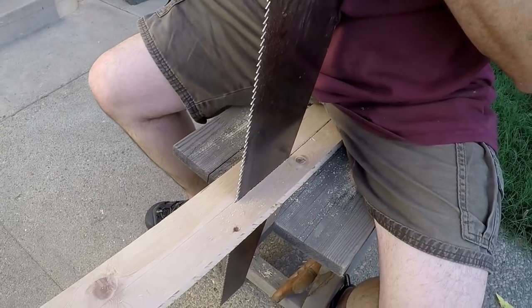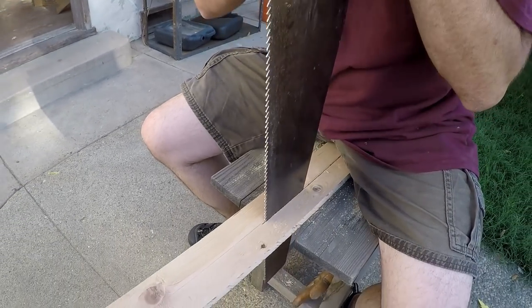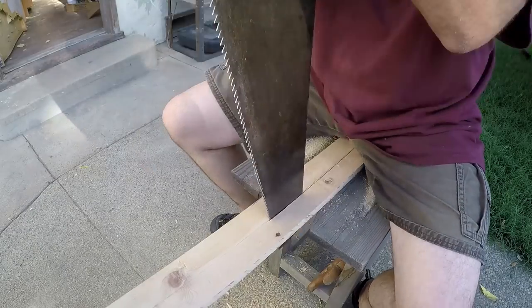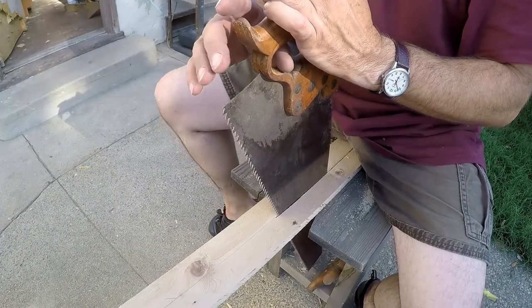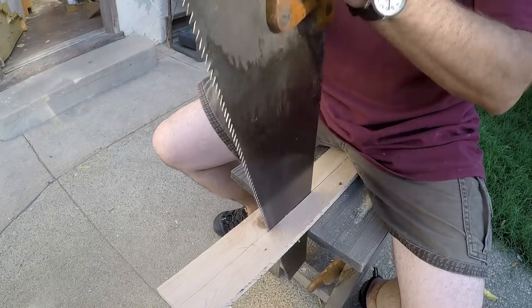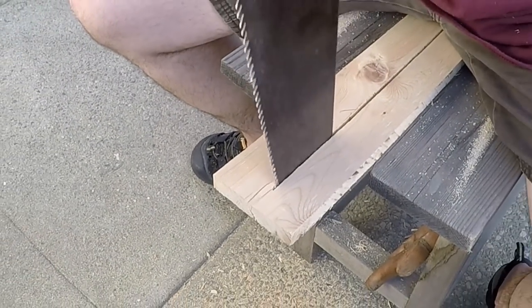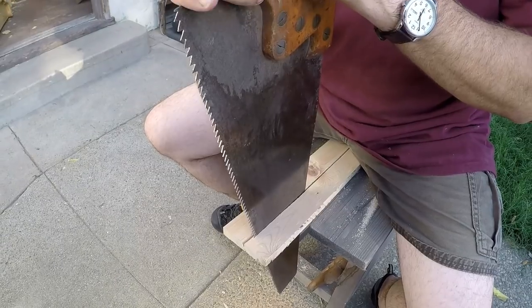You can also sit down on the blade and hold it this way — rip vertically. You guys can see my hands kind of like this. It's actually a very comfortable way to do this, and the nice thing is when you get to the end you can saw all the way right on out. I hit that knot and it started to jam. I let it kink, it twisted, and it broke the grain — we had some short grain going on. Not having good luck with my rip sawing today.